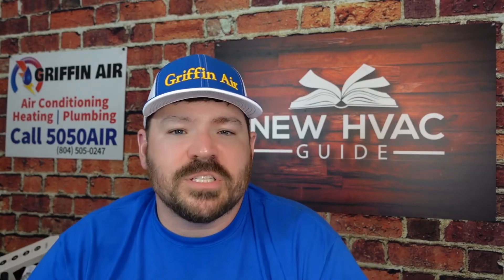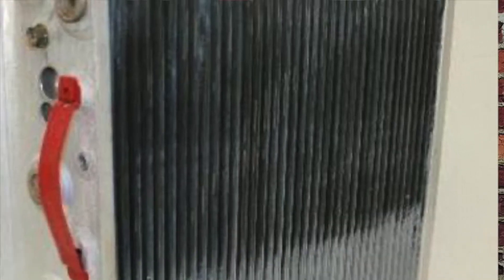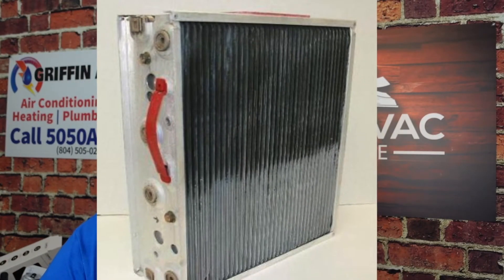Regardless, a lot of folks will see that little light on the electrostatic filter and think, 'Oh yeah, I'm cleaning my air. This is great.' Because they don't take care of it — and a lot of them should be cleaned regularly, I would say at least annually, but I'd argue they should be cleaned every quarter if not every month, depending on the traffic in your home and the type of system you have. Definitely every quarter those cells should be cleaned. Otherwise it is a useless product. You have a dirty filter and it's not cleaning the air like you believe it is. I think they're useless because no one takes care of them like they're supposed to.